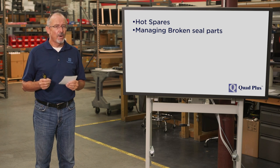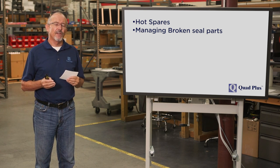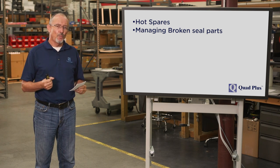Managing broken seal parts. This is very important, and probably most of you have been in this scenario where a drive has failed, you go to the storeroom, you bring the part out, open the box, the seal's been broken, you look at it, the board's dusty, and now you're wondering, does this component even work? I've certainly seen where they haven't. They'd been taken out, the person didn't understand what the first problem was, and then you start to call into question your entire spare parts inventory. So managing that is a very good idea.